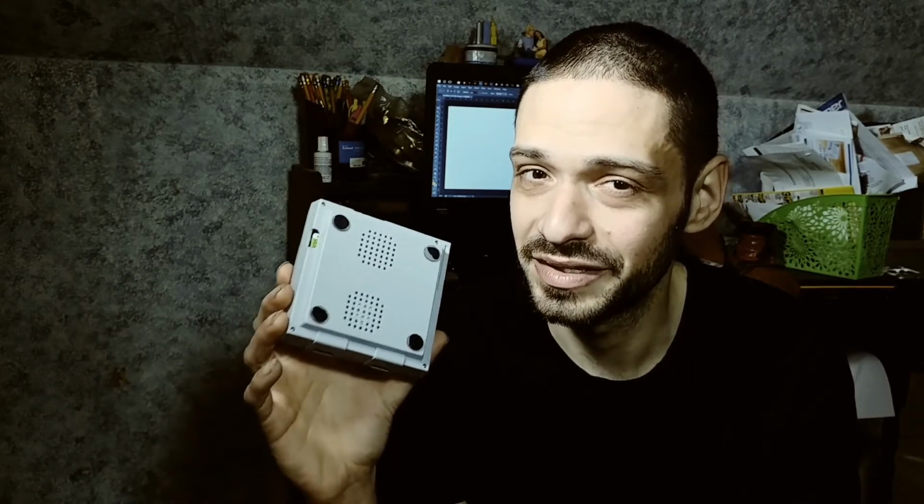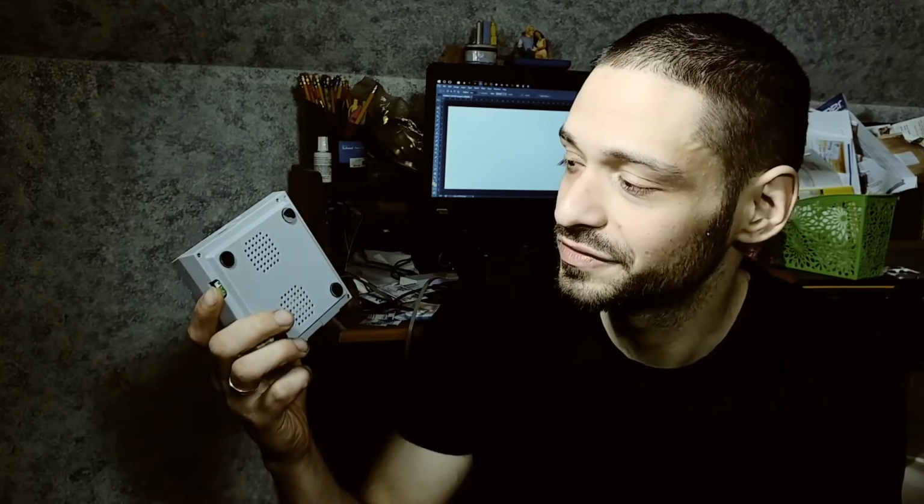There is a fan in here. Now I will say, originally when I connected this, and you want to keep this in mind, and you will see that on the DIY Dummy video, I connected the cable wrong. You want to make sure you watch out for that, because this thing started to smoke and almost destroyed my Raspberry Pi. The issue that I also had was that this thing seemed to overheat and shut off. The fan that's in here wasn't really doing a good job of keeping things cool in there.